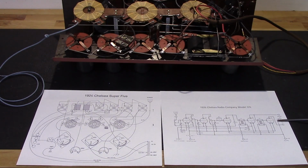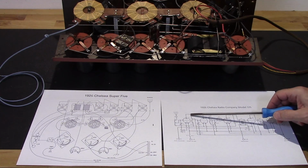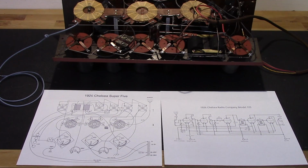again. It'll hit V5. This time you have to put the speaker between the loudspeaker jack and the plate in order to transfer that 90 volts over to V5, so it does not conduct unless there's a speaker plugged in, and that gives us our audio to speaker. Your 90 volts also comes back and supplies plate voltage to L3 and L2. So that's pretty much it in a nutshell.